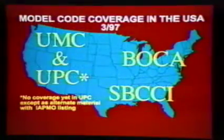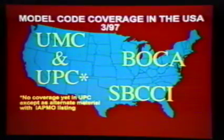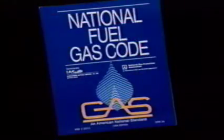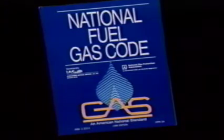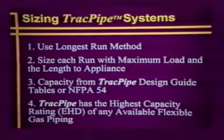Corrugated stainless steel tubing is recognized as an acceptable fuel gas piping material by most of the United States regional model code bodies. As you know, local codes take precedence in the event of a question. And if there is no code, installation must be in accordance with the most current edition of the National Fuel Gas Code.